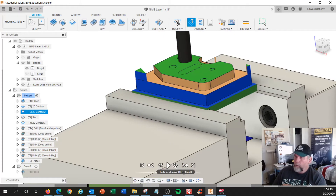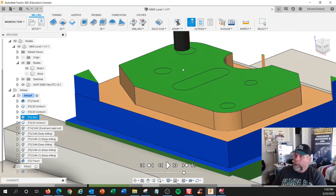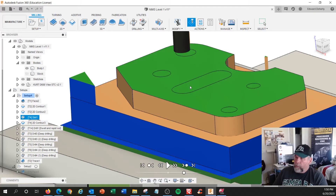How do we do this? What are we going to do with the holes or the slot? I'm going to do the slot. I'm going to use a smaller end mill. The slot, I believe, is 3/8 diameter, or 0.1875 radius. You could take the end mill and just go back and forth, but the finish might not be optimal. In this case you want to rough and finish. You could do a pre-drill-the-hole method and bring up the end mill and work your way around, but I'm going to use something called ramp milling — it's very easy to write.